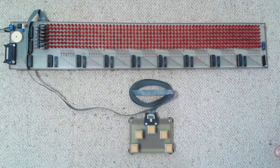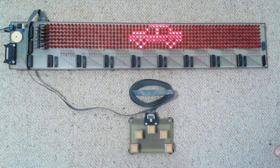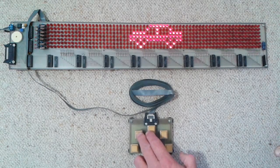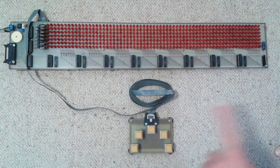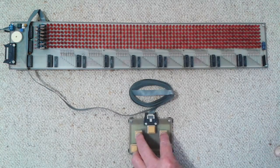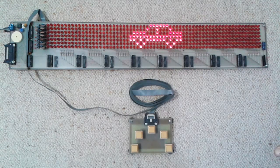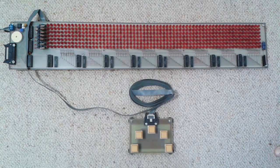The best way to illustrate this is using the car character. Let's get the car character up by using shift W, then display. There's the car symbol appearing and disappearing instantly. Now let's change the attributes to scroll in from the right and scroll out to the left — the parameters for that are E and E. So: E E shift display. Notice the display is unaffected at that point; we need to key in the car character again with shift W display. And now the car scrolls in from the right and out to the left. And if we take the hold time out, we can get it to scroll continuously.